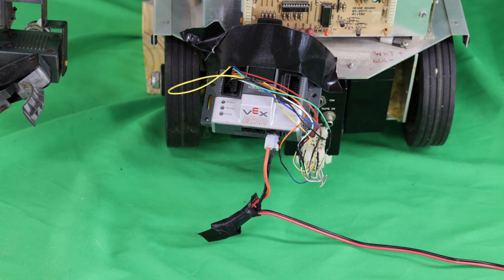I've been able to have it move chess pieces autonomously. It's that precise. You have to home it, and you have to get the stepper motor counts back. And that's one problem with this upgrade: you don't get the stepper motor counts back. The only way you could do that is if you probably used the robot interpreter and somehow read back the stepper counts, or you could use the Wintec Robot Basic that came as an upgrade to the Hero 1 and have it report back the motor and some of the sensors. Maybe it would report back the stepper motor positions. I don't know. I thought you could only give it an angle and it would just move to that angle.